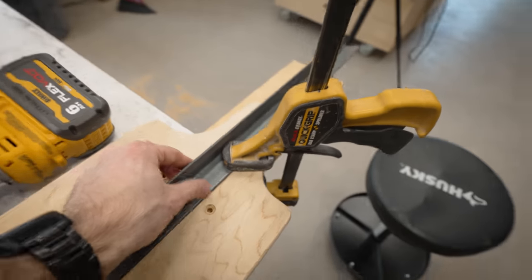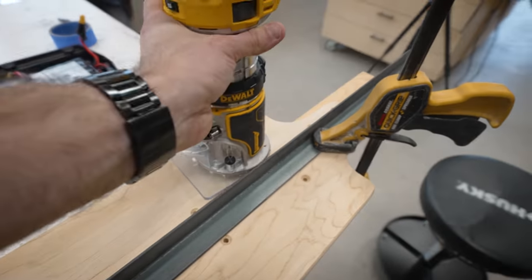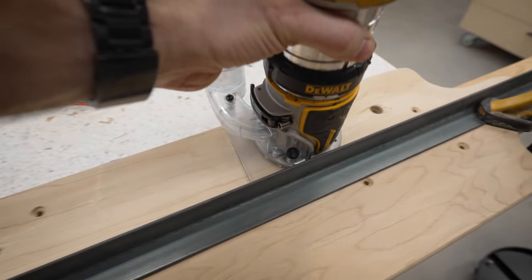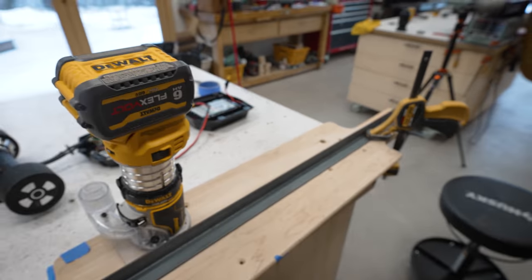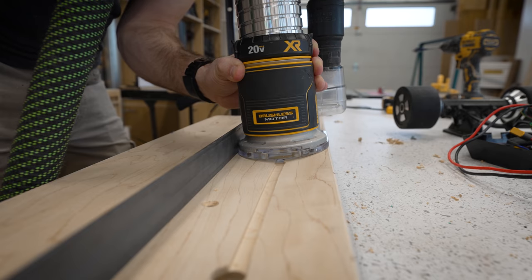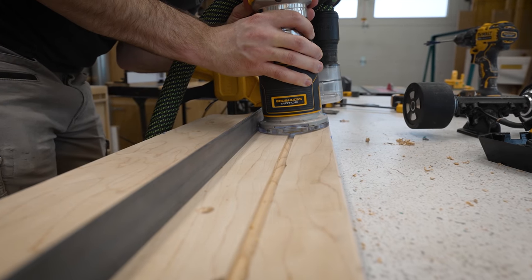I have this angle iron clamped right to the deck of the board the whole way across, and it's nice and straight. So what I'm gonna do is use that as a fence for my router. I'll set up the router along here, move it along so that it's following on the edge of the angle iron, and it should give me a nice straight line between the two points. I double check my clamps, set my router bit to 1/4 inch deep, and then carefully cut my channel from one hole to another while being careful not to overshoot my mark at either end.